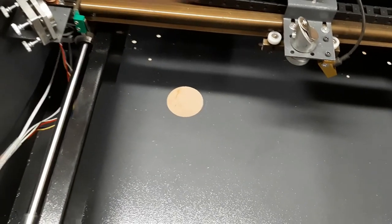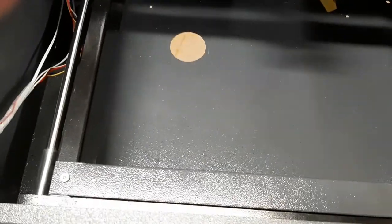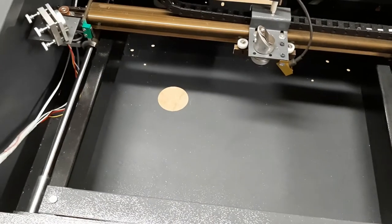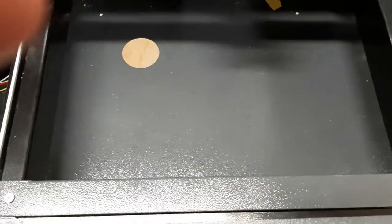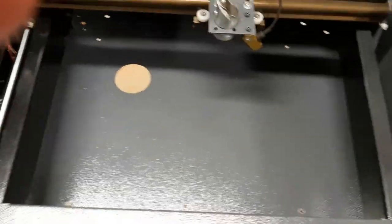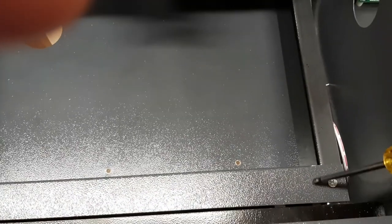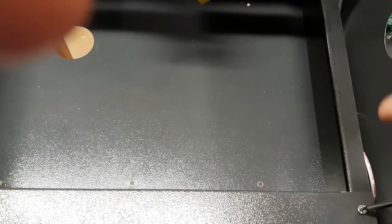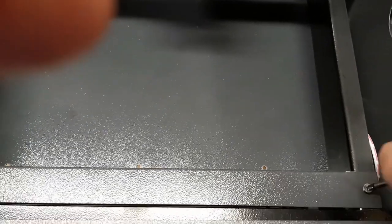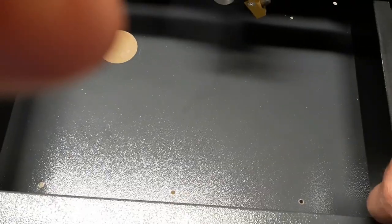So let's see what it takes to get down and dirty on this — an introduction into the K-40 X and Y system. In the front of this unit what you're going to find is a plate right here. It'll have two screws, one on each side. When you remove those screws you will expose the motor drive for the Y-axis.